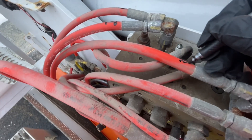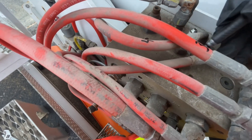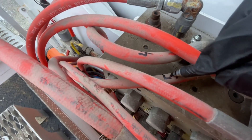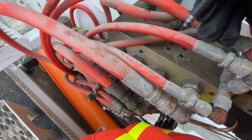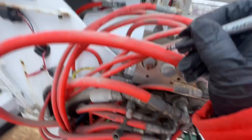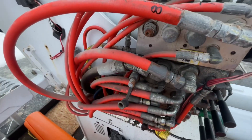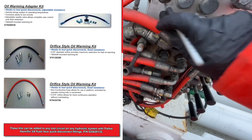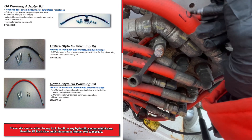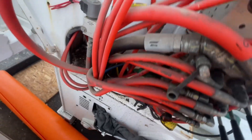Page 64 of the operator's manual actually instructs this. There's a tool circuit up in the bucket — if you want to use hydraulic tools like crimpers or cutters — and there's a 500 psi pilot circuit up there. The manual tells you to use a warm-up hose in the tool circuit and enable the tool circuit. I actually built one: it's just a quick-connect number six JIC hose, except it's got a little orifice — I went with 1/16 inch, which is 1.5 millimeters.